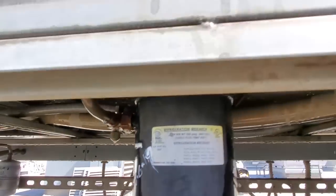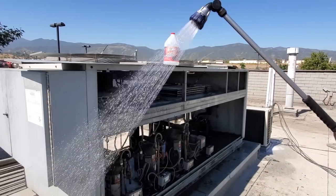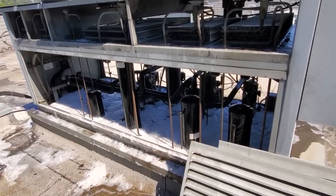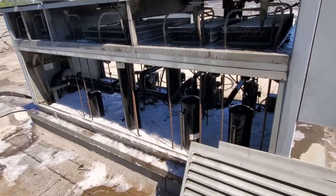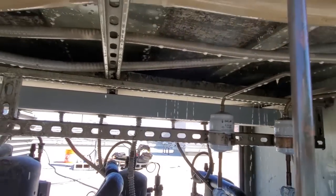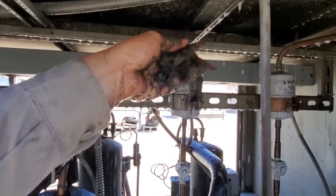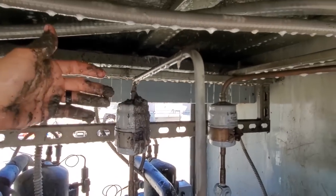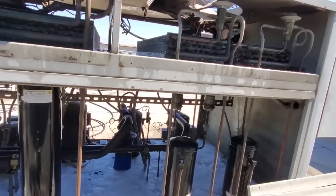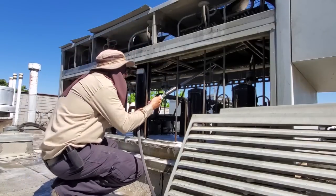You've got to think logically when you do this. You don't just go in here and wash coils — there is an art to doing it properly. This thing is a lifesaver — I'm going to put it on shower mode and it'll get right in there. There's obviously a lot of foam and water. I'm going to show you guys that drain pan. Right there is the drain pan — I'm going to stick my hand up in there and grab a handful of crap. Look at that — mud. If I don't get all that out, it's just going to suck right back up on that coil. Pure mud in there. That's crazy. We've got to get all that stuff out and be thorough.